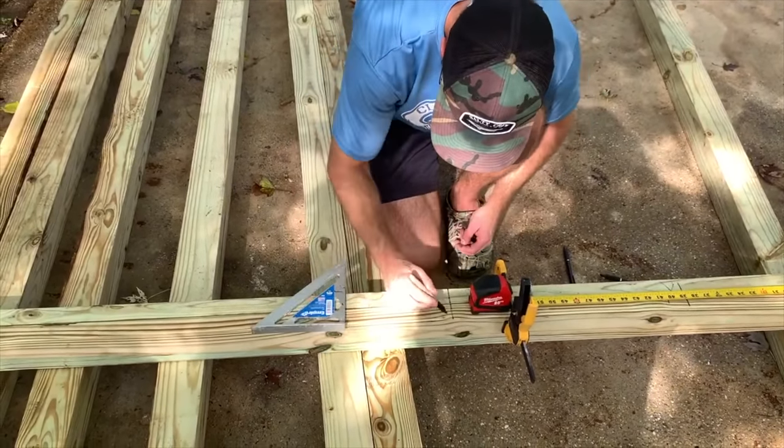And now I'm finally using the correct piece of equipment, which is a framing nailer. And I'm using 2-inch exterior rated galvanized nails, and I'm using nails every 8 inches on center or so. On the back wall there, you wanna ensure that the piece of siding is completely flush with the back wall and that it's not poking out, and then go back and hit all the intermediate studs with nails.